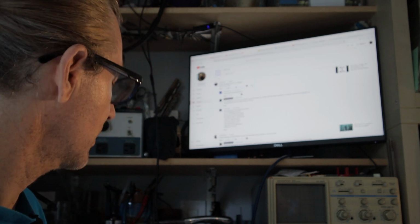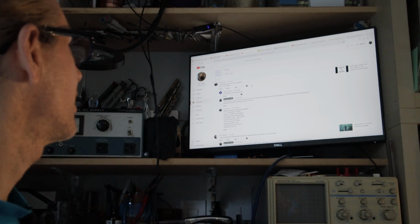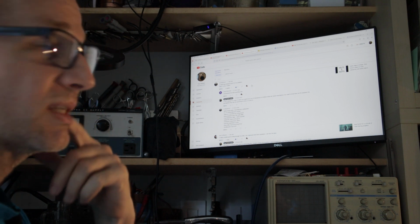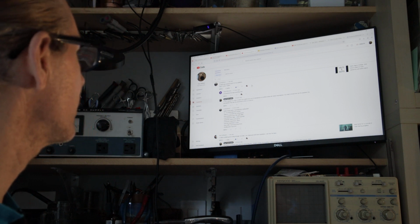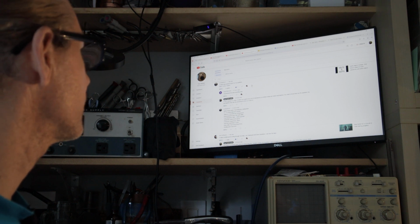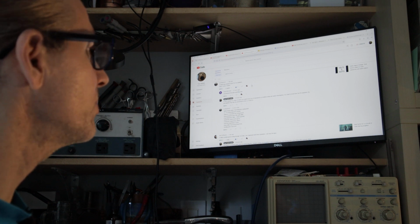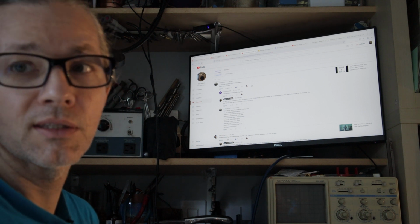And I made this video inspired by Scott Spinner, because he asked me a question. "Hi, what amp would be good for my speakers? 94 dB, 6 ohm." And I told him that we need quite a bit more to find out what's going on, and he was super nice and gave a lot more information: what drivers there are in the speakers, what the recommended amplifier wattage is, what the frequency response is, and that the sensitivity of 94 dB was given at 2.83 volts at 1 meter, and the nominal impedance is 6 ohms.